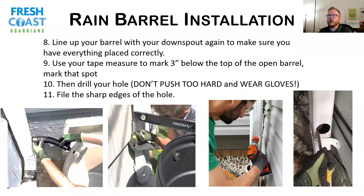It's important to know that there are different downspout sizes and where you drill matters. If you have a larger downspout — usually three inches by four inches — you want to put the hole on the side. But if it's a standard downspout — two inches by three inches — you want to put it on the front. That's a very key thing to remember. You can easily measure to find the three-inch-wide side — that's the side you'll drill into, because that's also how wide the diverter is.